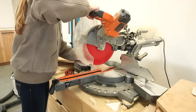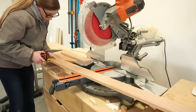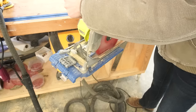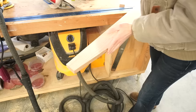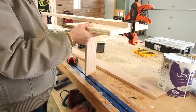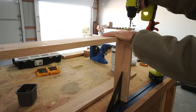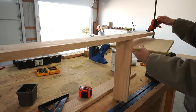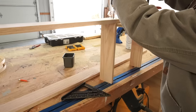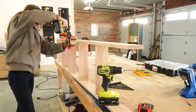I built the ladder from 1x4 oak boards — I think pine would have worked fine, but oak holds a bit more weight and looks nicer. I cut the ends of the ladder sides with a 10-degree miter so it would lean. Then I used a square to draw a line perpendicular to the top edge about 2 inches from the front, cut along this line with a circular saw, and this flat area is where I mount the rollers. I then just screwed the rungs between the two sides, using a scrap piece of plywood to evenly space all of the rungs and keep them parallel to the 10-degree angle at the bottom. I could have made this stronger by cutting dados for the rungs, but this ladder is mainly for decoration and I'll only be using the bottom rung, so screws are more than enough.